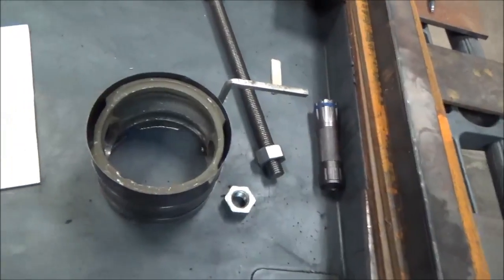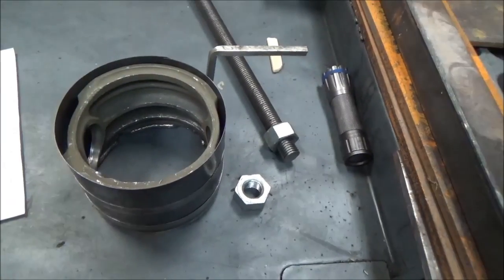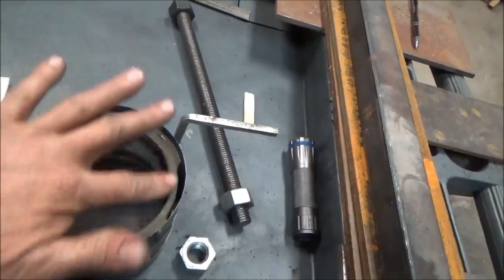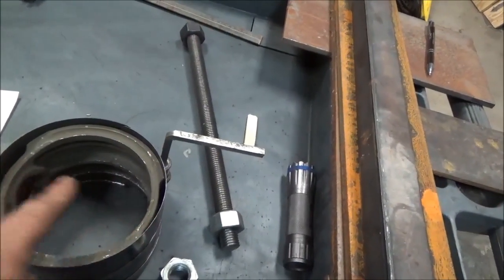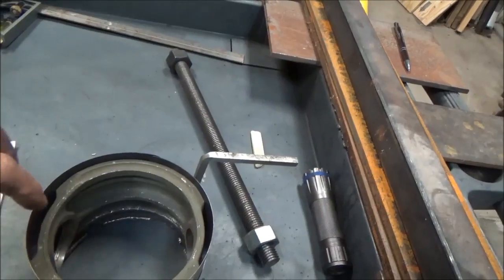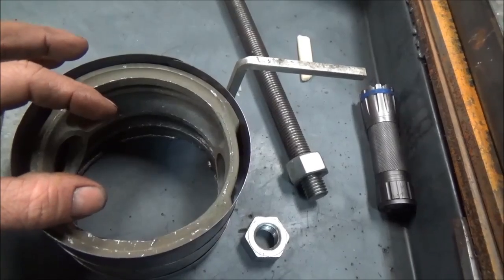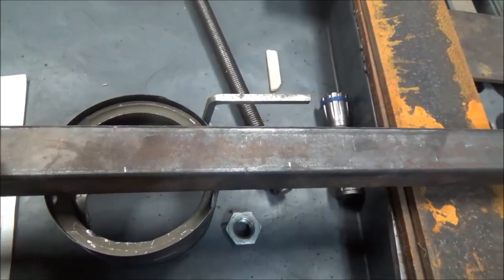Hopefully I won't cut anything too small where I have to weld it up and then machine it down. I wish I had one of those cylinders that's going to go in, but they haven't arrived yet — they're on order and it's too cold to go outside and check these parts in the block. I'm going to make them tonight and maybe tomorrow. This right here is the broken piston that came out and I just got a ring compressor around it, so that'll simulate the size of the cylinder. It'll be about a sixteenth of an inch wider than this across here — I want it to be slightly loose. We can always shim out the outsides with washers. So that's the plan for that.